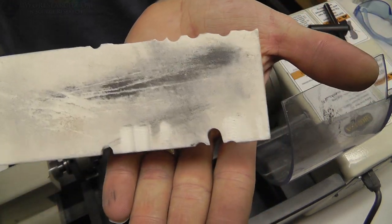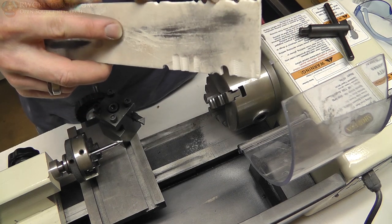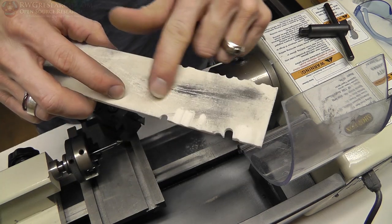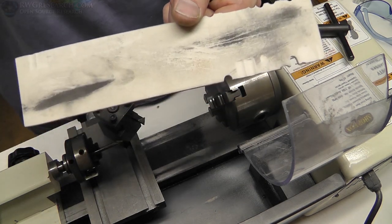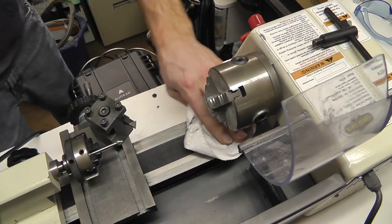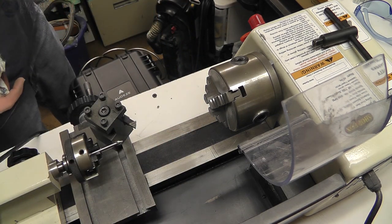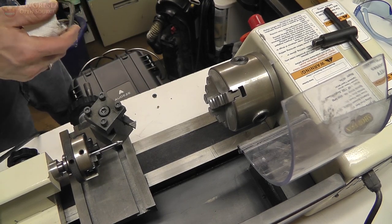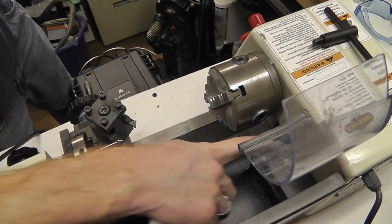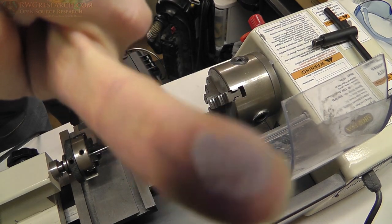I got the three of those done. It definitely took some beating on my stone. This is a really weird stone — not your normal standard type. It is porous all the way through, so you can use the entire thickness, but it is actually thinner and rougher on the other sides. Once you get into it, it feels pretty much the same grit. I don't know where I picked them up — could have even been Harbor Freight. They are cheap and they do break easy. Quick side note: you definitely want to make sure you wipe everything down real good, because you get that grit between the parts and it's going to wear fast. Be cautious about using a stone around a lathe bed or any sliding precision parts — you don't want to contaminate it.